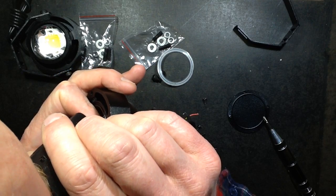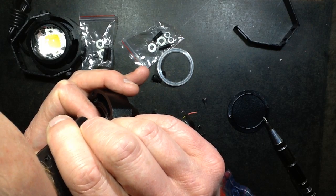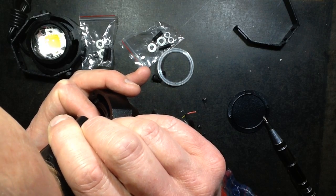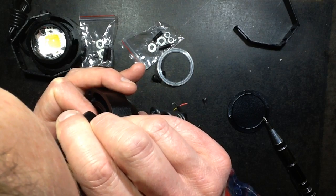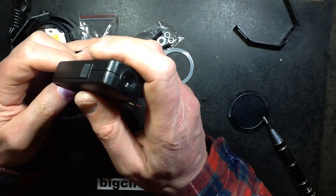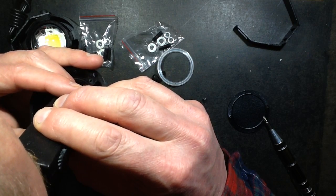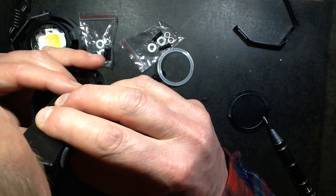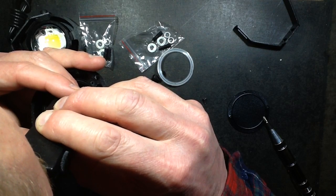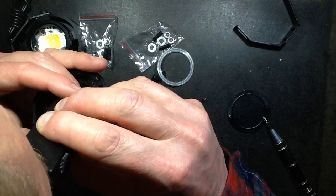Let's get the microscope out. There's a complete lack of identifying numbers on the 8-pin chip — it's the usual anonymous 8-pin chip. But the other component is probably the regulator, marked PT4115, and underneath it says 4-4-7-THT. So the important part is PT4115 — I'll look that up and leave some data in the description.